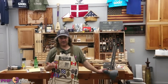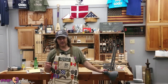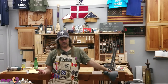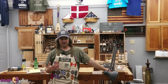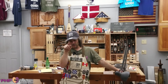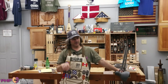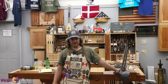So I prefer air-dried lumber for that reason. The downside to using air-dried lumber is I bought a fairly large load of white oak, cherry, and maple, I thought it was, from out west, western United States, and it was all air-dried. It was beautiful wood. I shipped it home, and some point in the next year or two, I discovered powder post beetles. Powder post beetles leave a little pyramid of dust underneath a little exit hole, which is a perfectly 16th inch diameter hole. And they have quite an appetite. They destroy everything. And I had pest control come twice to try to eliminate the problem. I ended up having to burn all that stuff. It was the only way to get rid of it.